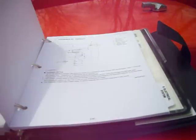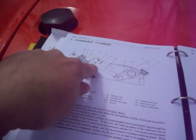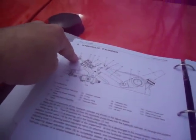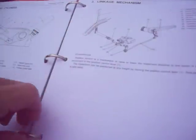In the manual, it talks about the circuit and how things work. It shows a diagram — this is your lift arm and this is your cylinder. The three-point hitch only raises and then it floats down. This is your bleed-off valve; depending on the weight of your implement, you can speed up or slow down the rate of fall. Your valves are underneath.